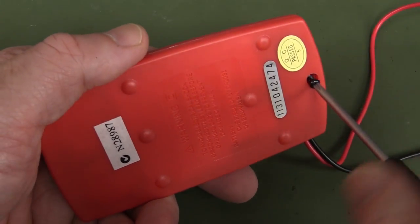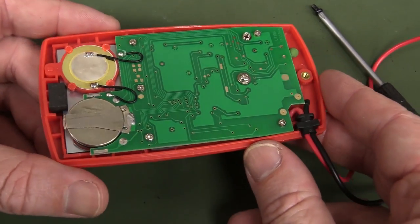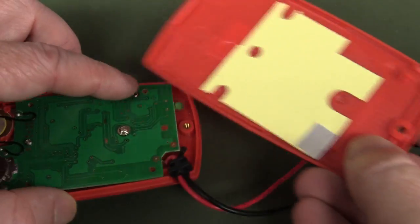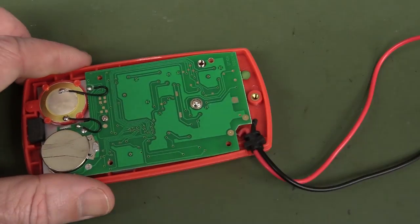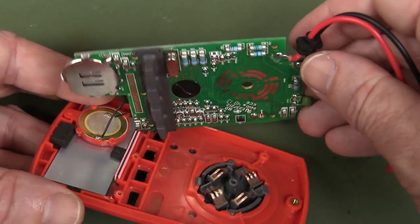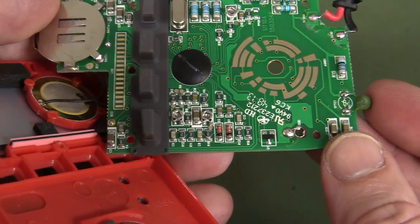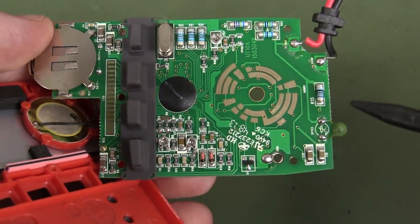No battery door — just one screw to get in. A metal threaded insert! Thank you very much. At $12, our first metal threaded insert. The inside is nice and clean. Strain relief with the rubber baby buggy bumper. It's even got shielding! Uni-T are serious — they're getting a lot of their meters UL listed these days. You can change the battery without taking the board out. Switch contacts look good, trimmer pots all fine. Input protection is one PTC, which is pretty much all you're going to get in these. Spacing and layout looks quite reasonable.